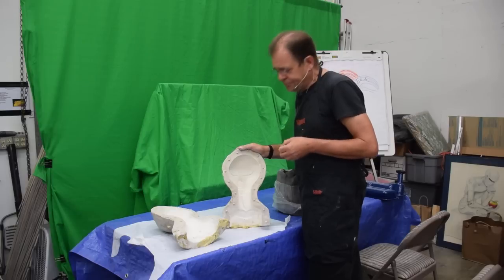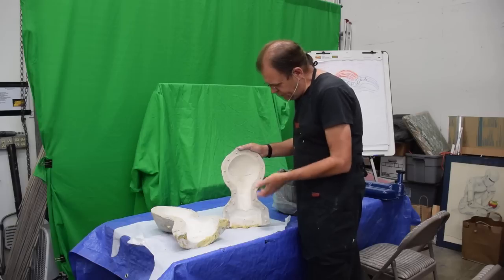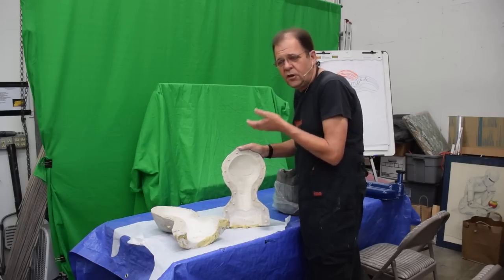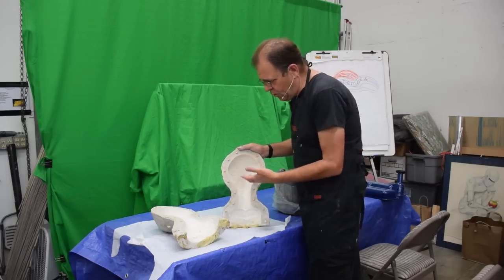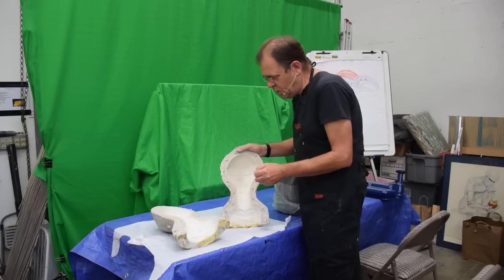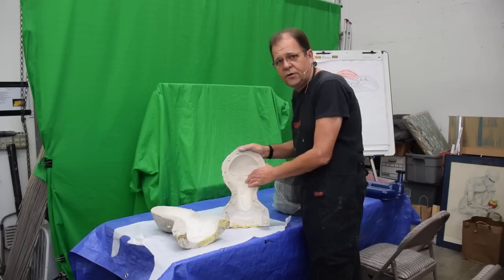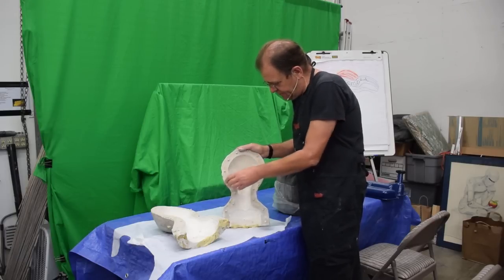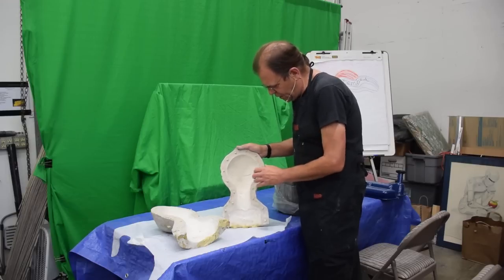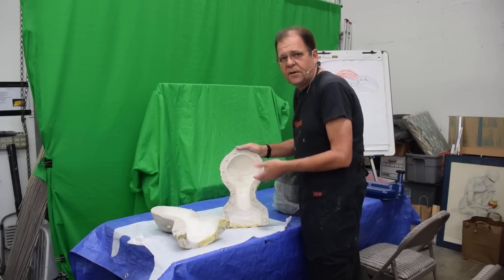and it creates a lot of work when I'm making up a bust. We have lowered the price, and the reason for that is that I'm going to clay press this mold. So what's going to happen is I'm going to push clay in here, and then I'm going to put more ultracal inside, and take the mold apart, and that will give me a sculpture from this mold that is identical. There'll be a few little pieces of damage here and there where you pull it open, but it's very easily retouched, resculpted and cleaned up.